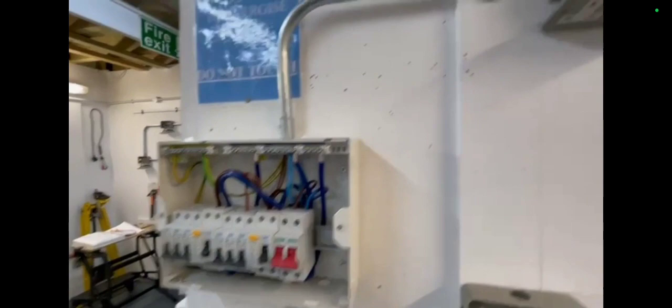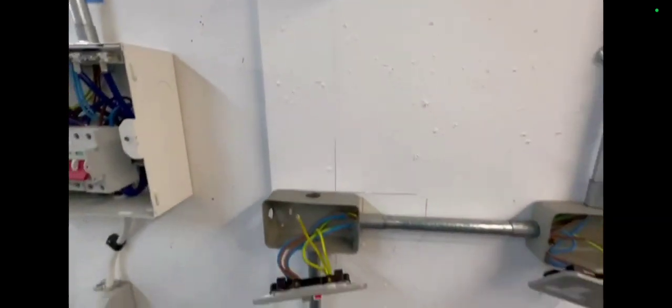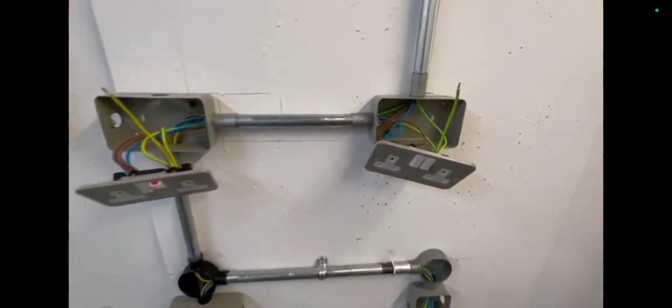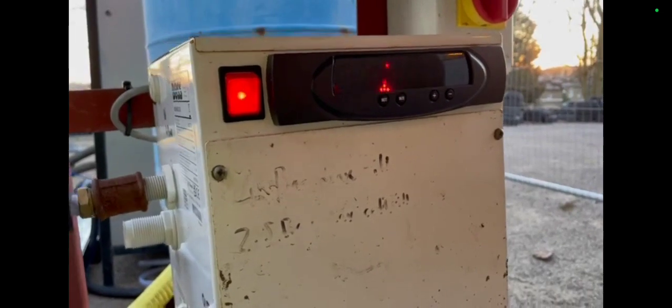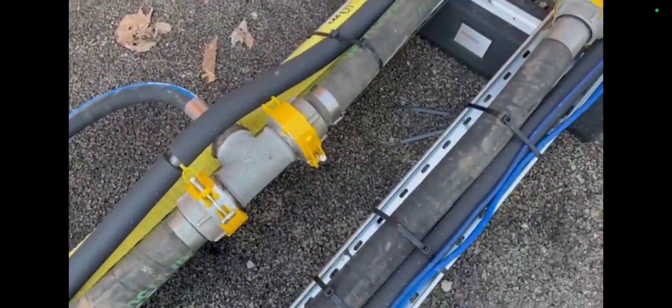On this side I have a socket and a ring circuit, with sockets down here. So at this particular site they had no central heating, so I was checking the temporary boiler, making sure it was running — and it was. But we had a problem with the flow, so straight away I had to trace to see why the heat wasn't getting around the building.